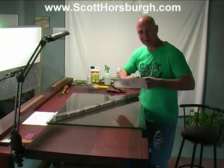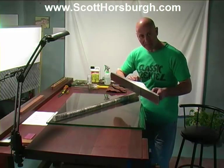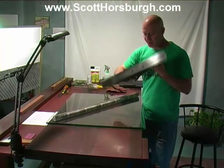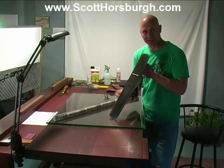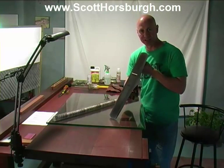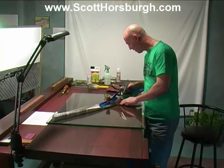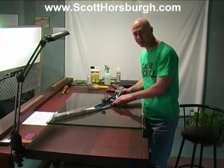I've also just very briefly done the sides just to clean them up. I'm not too concerned about actually making them perfectly square with the sole, because when I am using the plane on its sides for shooting, if there's a small error, I can easily rectify that by placing shims on the shooting board.